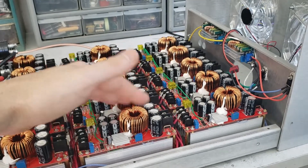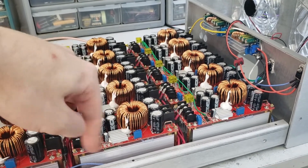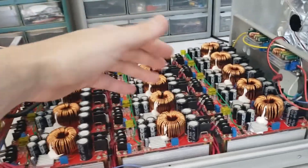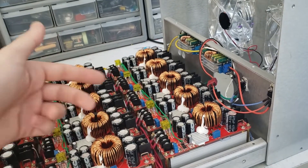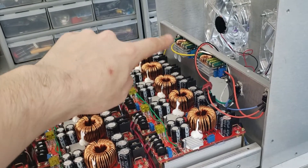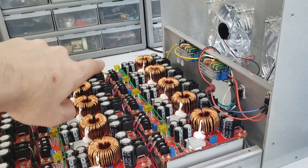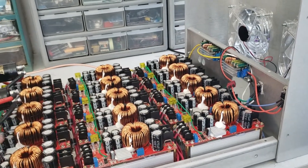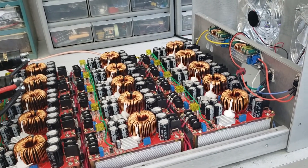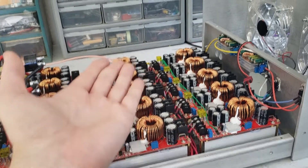Another hurdle I had to overcome was turning these on and off on demand, and that's these green wires here. If you watched my previous video, I had to connect an external power supply into the control section of the board. This is a buck-boost module — if the voltage on the input drops below 10, 9, maybe 8 volts, even briefly, this buck-boost module will keep the control voltage on these modules at a constant value. By turning off the control voltage — that yellow wire splits into all these green wires carrying 13.8 volts — if I disconnect all those green wires from 13.8 volts it shuts off the control circuitry for all the modules and turns the power supplies off. By switching that voltage on and off it actually fires these modules up really quickly, about 40 milliseconds from the time the switch closes to the time the modules are all up to the correct voltage.